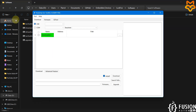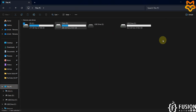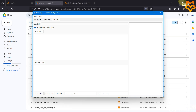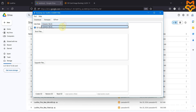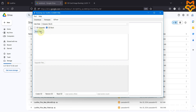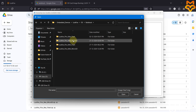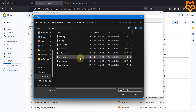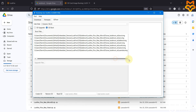Open the SoC Toolkit software. To flash the image onto the SD card, go to the SD Tool section rather than the Download section. The SD card may not appear even if plugged in — remove it and re-plug it, and you should now see it listed as 58.2 GB. Select the SD Boot option and click the Boot Files button. Navigate to the BuildRoot operating system folder, then to the LuckFox Pico Pro Max micro SD card image, select all files, and exclude the update.img file, then click Open.